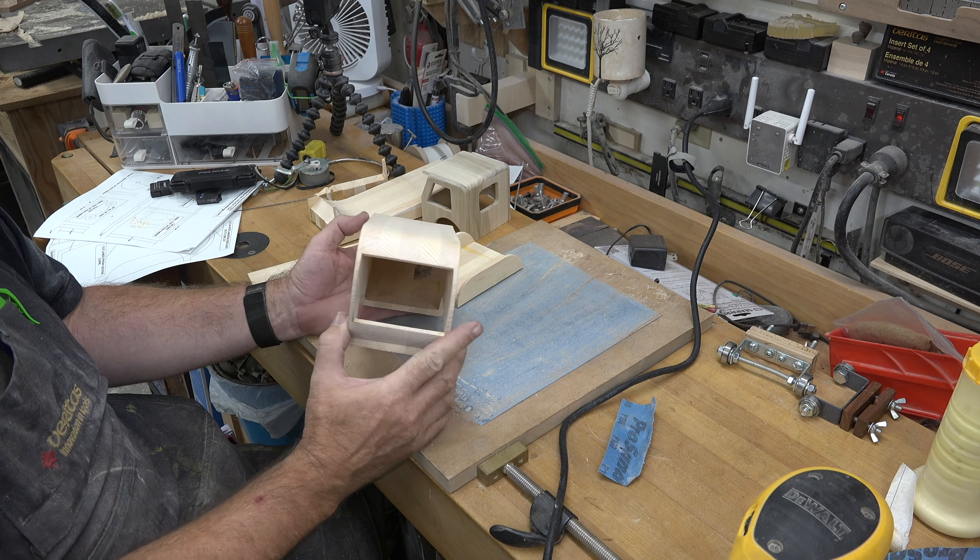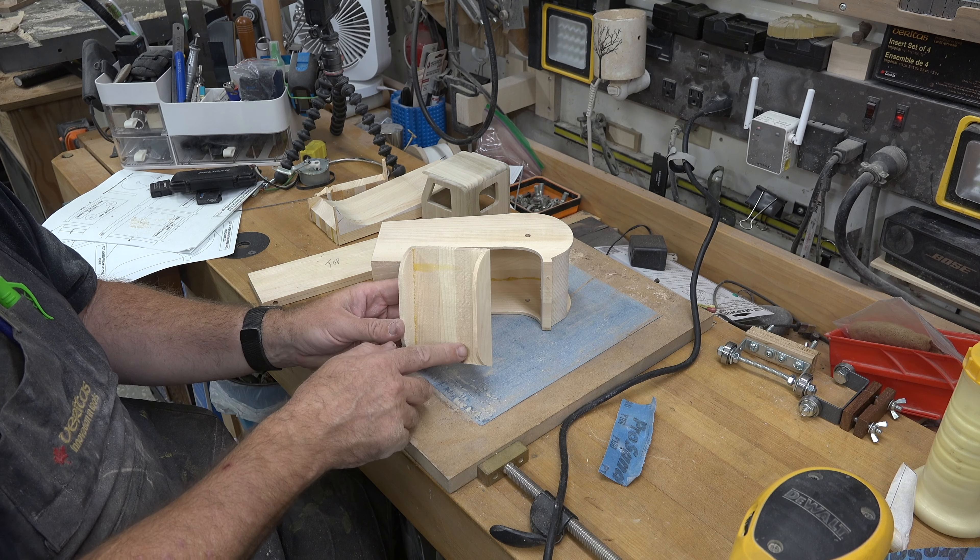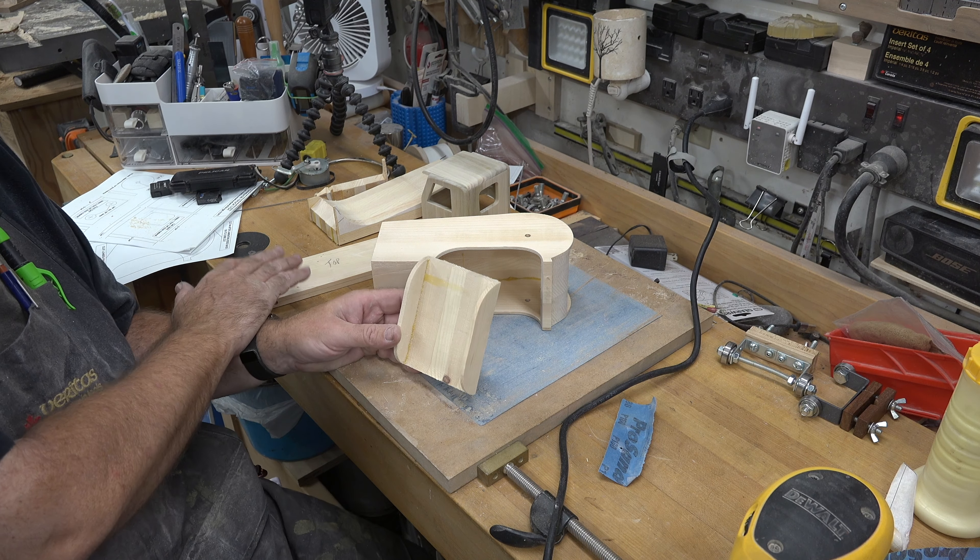When you get that cut, this ends up being the back of your garbage truck toy. There's a little bit of a mess-up with the cutting — that's okay, I can sand that out. This is a tough cut for a three-sixteenths inch blade on the bandsaw. Two things cause that: the small blade and the thickness of the material, and the fact that it's pine. Pine sawdust compresses and gets caught in the kerf and can very easily burn. You really have to take your time and do a very slow cut to give the gullets of the bandsaw blade time to clear that compacting pine dust.